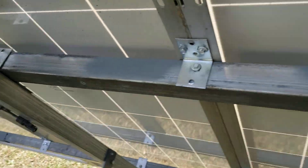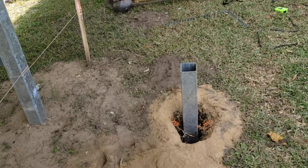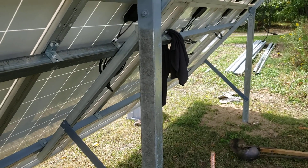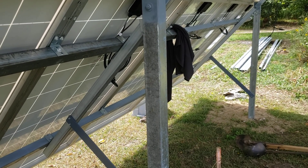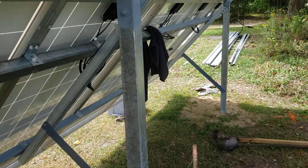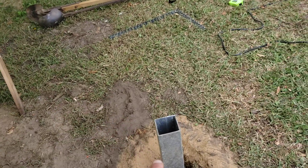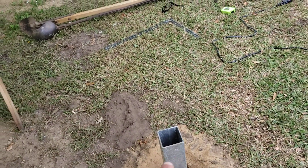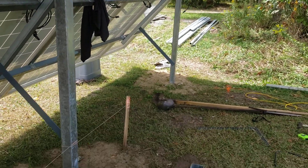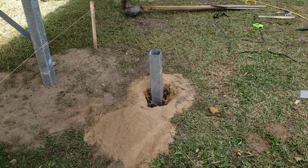It's dirty but it's not rigid enough, so I'm gonna cement these into the ground and then run a diagonal. Probably one-by-one square tube, could use angle iron — not sure yet. I'm gonna weld a brace that'll go basically from up here on a diagonal, welded right across, and that'll take that wobble out.